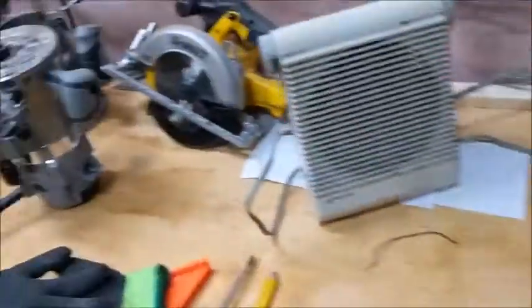I know it's hard to see, but it's about a 1/4 inch depth. I'm not going to move my router bit, so it should hopefully match the table. Since it's 1/2 inch on both sides, I'm going to go around and do a 1/2 inch in on each, all the way around the 4 sides, and then I can cut it out based on those, and then I can router around the rest. Okay, so I'm going to cut this out and then I'll be back.